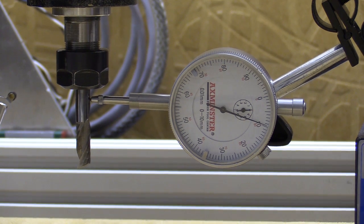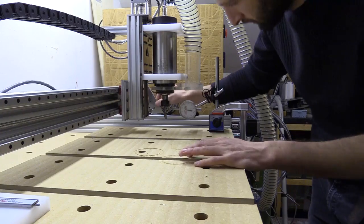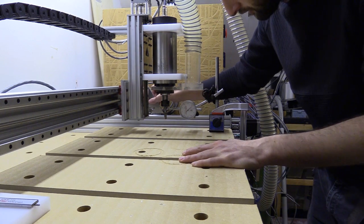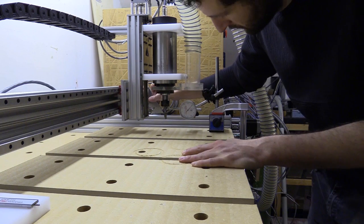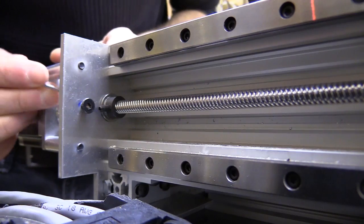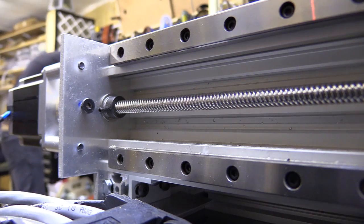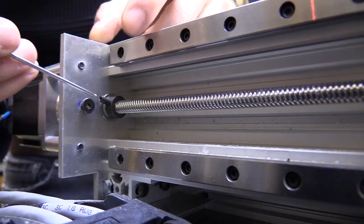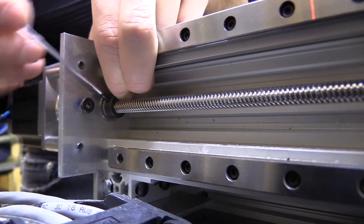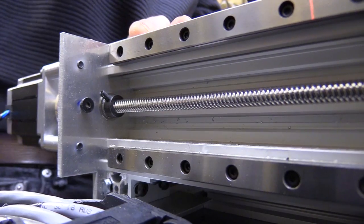There's backlash in the machine. I think maybe the coupler or the locking collar has got loose on this side and that's creating that backlash. It looks like it's this section here that's loosened up a bit. It could be any number of things — something slipping on the other end, the motor coupler changing its tension over time, or the grub screw on the locking collar just slipping.